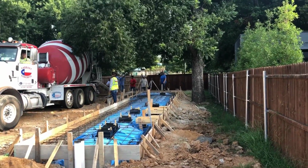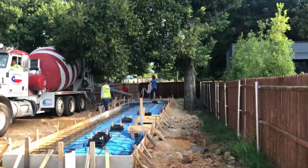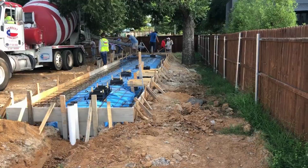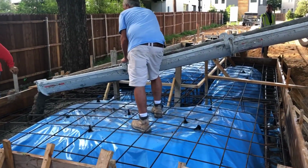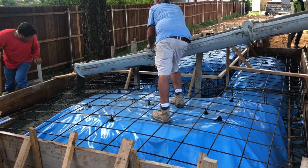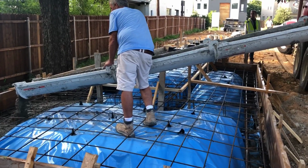And then we're going to set these rear containers, which require a crane, under these high lines, which is really tricky, and with all these trees. And then we can move forward and pour the main house foundation up here, and we won't have to get a crane back here again. Got some really big beams in this little bitty foundation. It's totally stupid, but the engineer requires all that. Even though the container sits on the peg legs on the corners, it bears no weight anywhere except on the corners. The beams are a total waste of money and concrete.